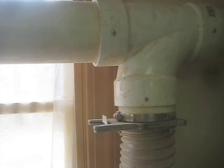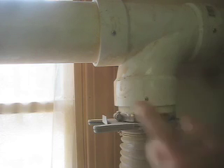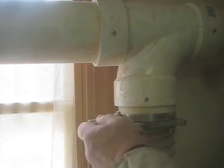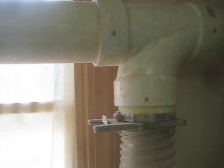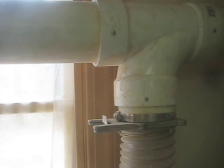You'll feel it shrink more and more, and if you were to undo this and take it off, you would actually see a tapered lip — it's almost square-edged. This is permanent; it doesn't come out. Before I started, it was loose — about an eighth-inch gap all around it. So you can heat PVC — I think you're supposed to have adequate ventilation, by the way — and then use a band clamp like this to continually shrink it until you are satisfied that you have an anchor-tight fit.